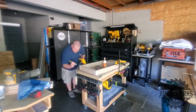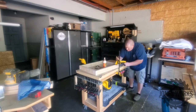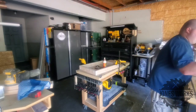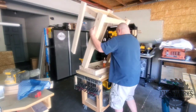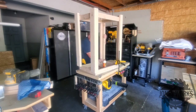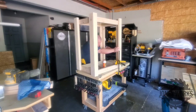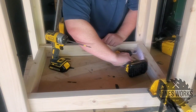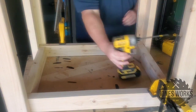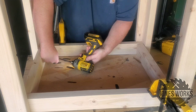Just a closer look at how the legs attach to the stretchers: the two leg pieces form an L, and the longer side of the L overlaps the two stretchers' seam. This side's shorter and it doesn't need to cross the seam, so it goes on the full stretcher piece. For the top platform, the two-by-fours were pretty badly warped and twisted, so after gluing it together I clamped it to my workbench and set the whole stand on top to make sure it was as flat as possible. To make sure it didn't pull out of shape before the glue dried, I threw a couple screws in from the inside — so you'll never see these.